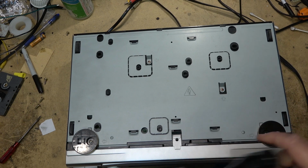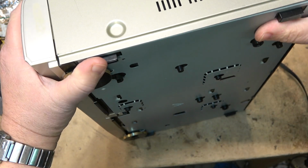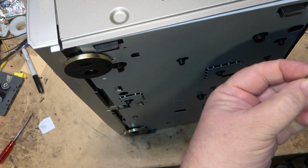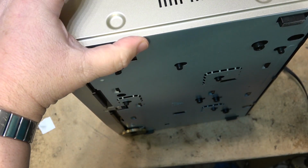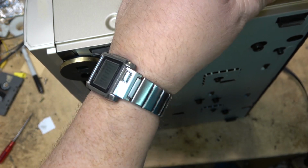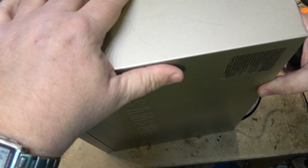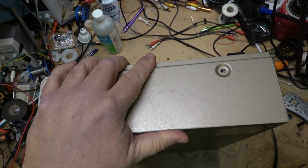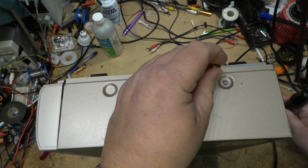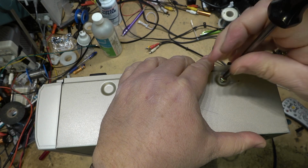We used to get, oh, it was ridiculous. When we first started doing conversions, we were making like $50 an hour to transfer a tape. And I think when I first started doing it, it was around $25 an hour, to transfer PAL and SECAM tapes. See, the advantage to the AG-W1 is it could do SECAM. This one could only do MESECAM, so it can't do the French system, whereas the AG-W1 could.